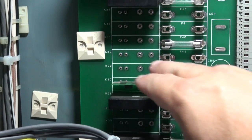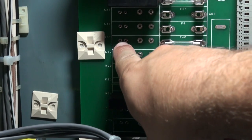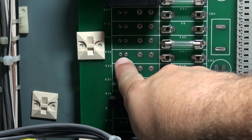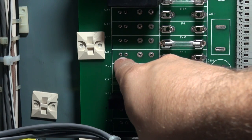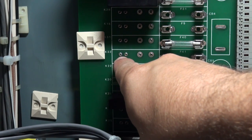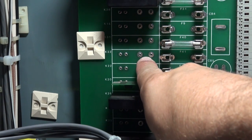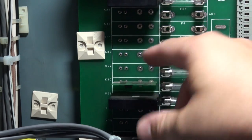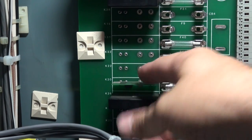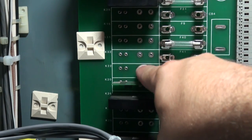Now normally you would put a solid state relay in one of these slots, and these two little pins on the side trigger the solid state relay. Normally you put an opto isolator or something like that, a little LED that will then turn on a higher voltage or a higher current switch. So these could actually drive 120 volts, which some of them do, or it could drive 24 volts, or 12 or 5, or whatever you hook up to this and whatever module.